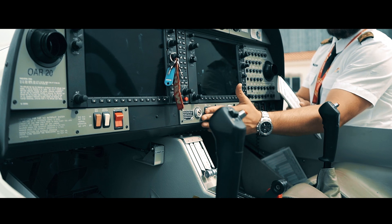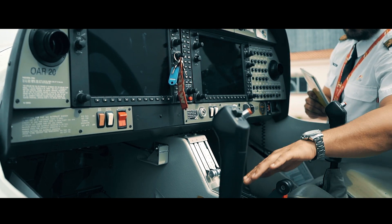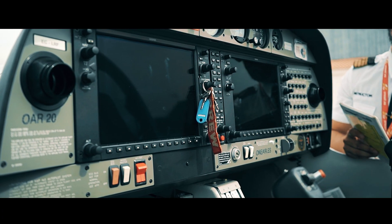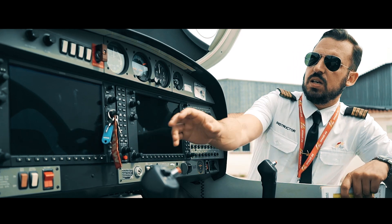These steps form a scan flow, ensuring that we check that everything is switched off, closed, cut off, and the RPM lever forward. Parking brake set, the ignition off and the keys out. Once we have finished with this, we turn on the generator and check the lights.